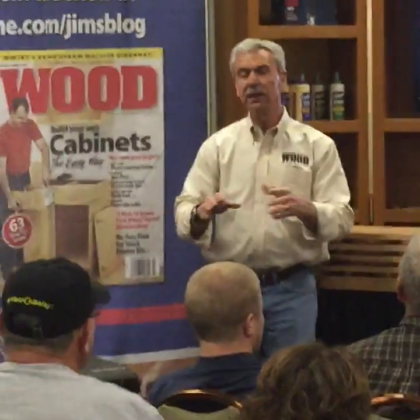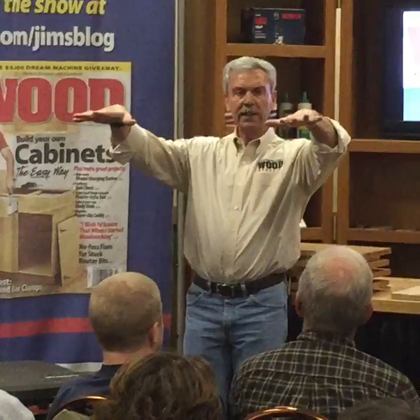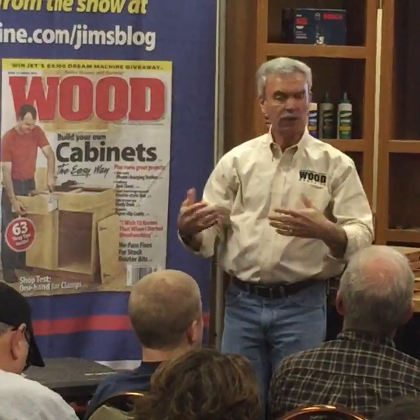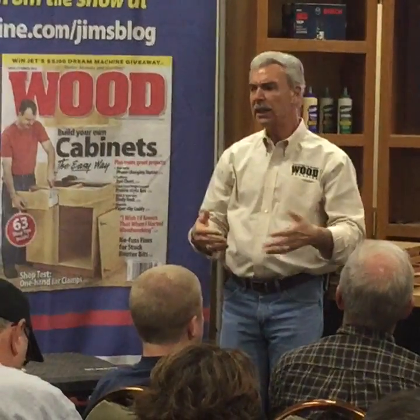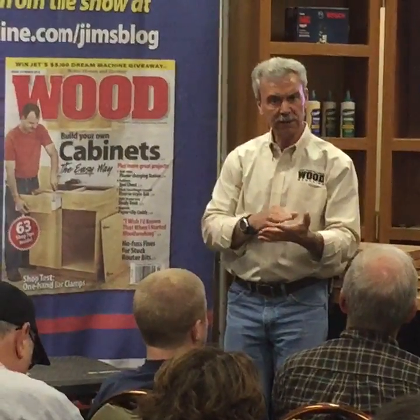So the idea is to look for as solid a wood as possible and as flat a wood without twists or cups. I never buy a board with a twist. That's a board that when it's lying flat on its plane, it's kind of twisted on the ends. Well, you can buy 2 inches thick and not get a 3/4 inch board out of that. And you have to have all the tools to be able to do that. So eliminate those potentials. So be that obnoxious person and buy perfect stock.